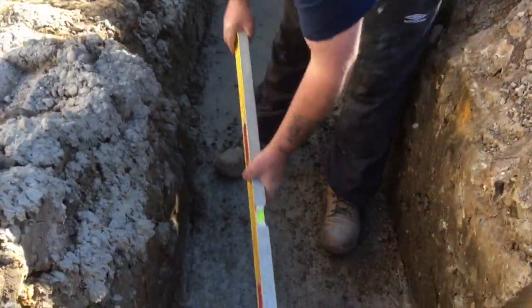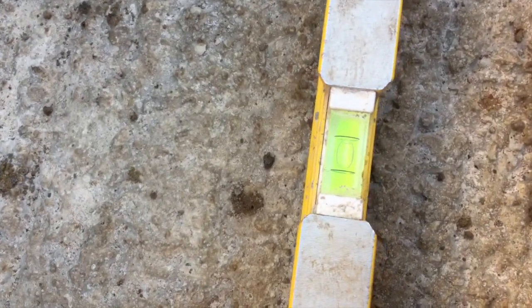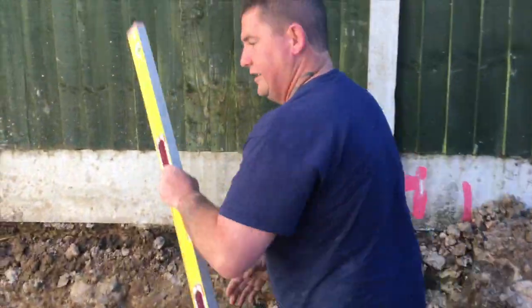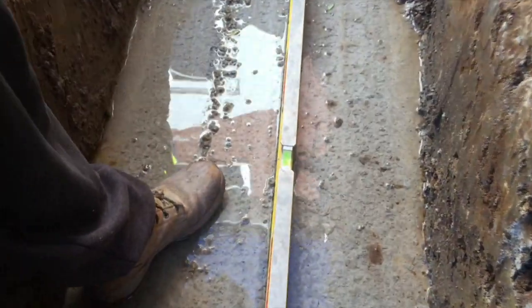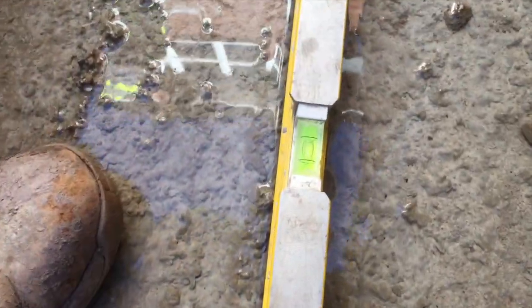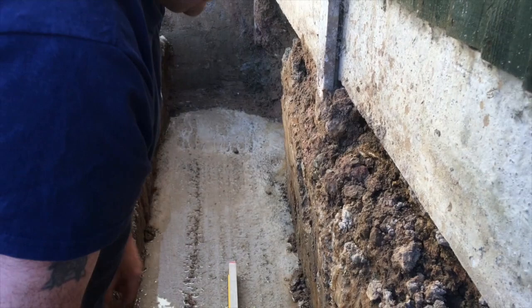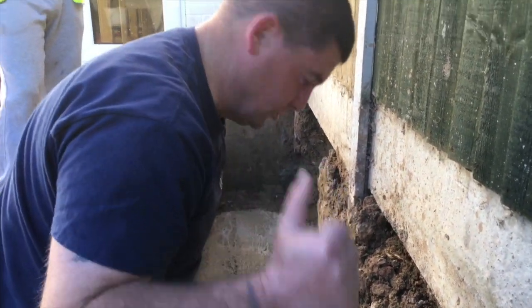This is a result of perfect planning. As you can see from the last video, Chris pegged everything out in the footings absolutely bang on. Let's show them down this side as well. Come down here, everything bang on — you can't get better than bang on. Make sure when you peg your footings out that you level off the existing, pull it all the way through, tamp to the top of your pegs, and away you go.